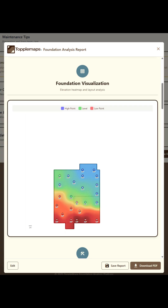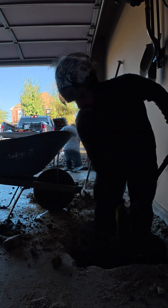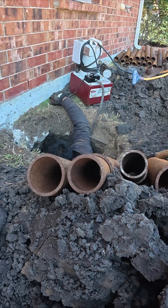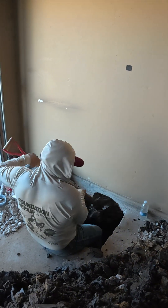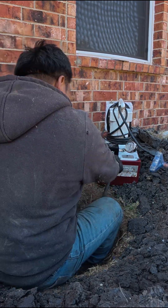One of the biggest questions we always get is why we place piers exactly where we do. The answer is simple: every pier must connect directly under an existing load-bearing beam, interior and exterior, so we can lift the house evenly without creating stress, cracks, or future cave-in.